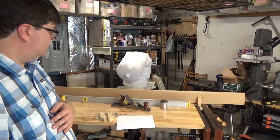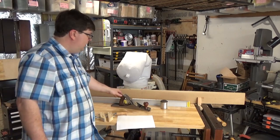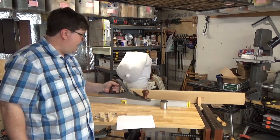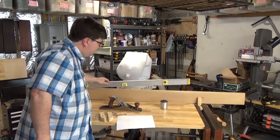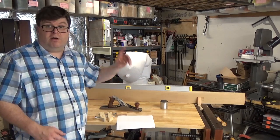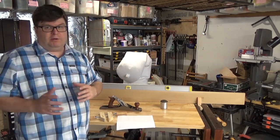And because I'm folding two pieces of wood on top of each other from the same board, I should get pretty good color matching as well. I just got done planing down the high spots with this K Tools 5½, and all I really need is for it to be straight enough to ride against the fence on the bandsaw where I'm going to rip it down.